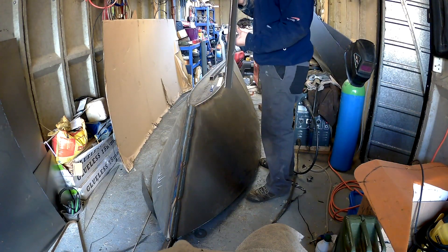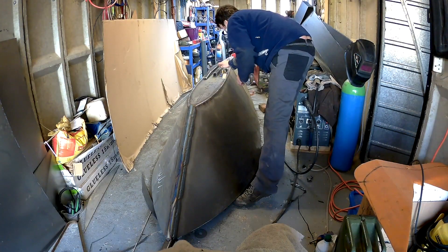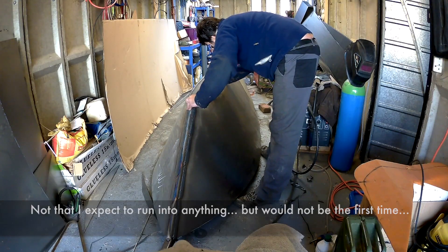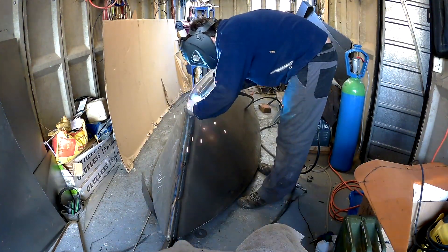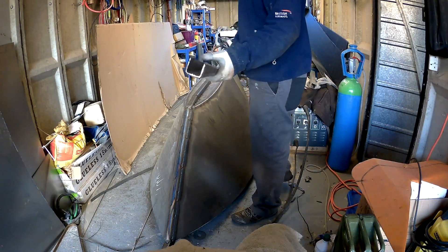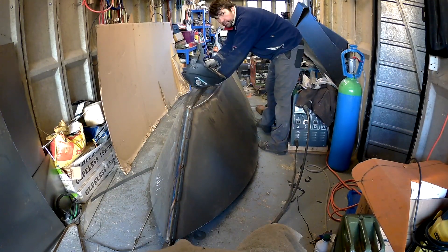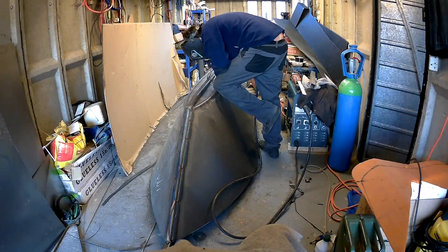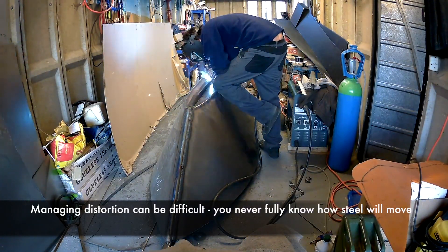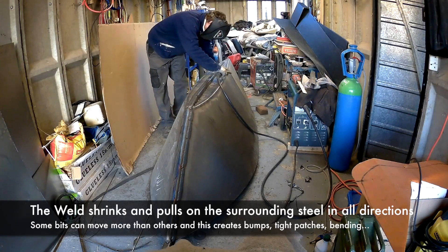Now I'm going to put some bits of channel on the bottom of the keel. This is essentially the bottom bit of the boat that will contact the concrete blocks when she's on the hard, and should I run into something, this will be the bit that hits the rock, so it needs to be nice and strong. I got a 4mm box or rectangular section and cut it down to make this shape. One thing I'm trying to do here is weld each side in tandem to reduce distortion and ensure it's equal on each side. With the base bit now welded on, it's really coming together and becoming a lot stiffer.